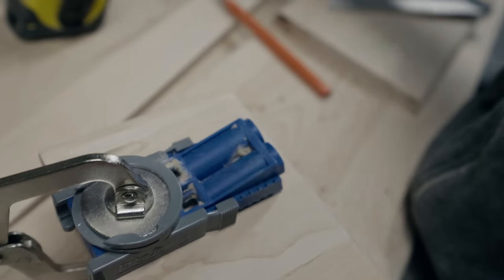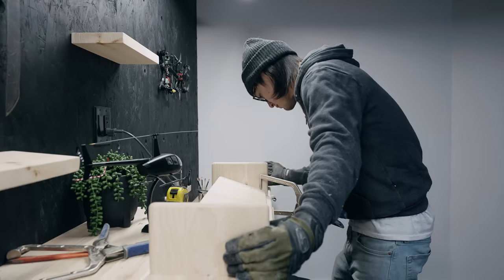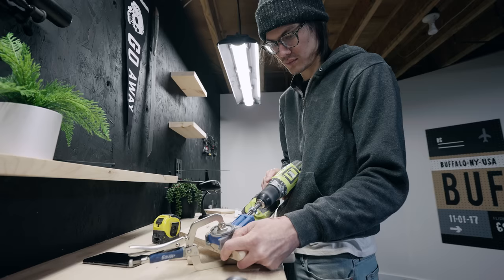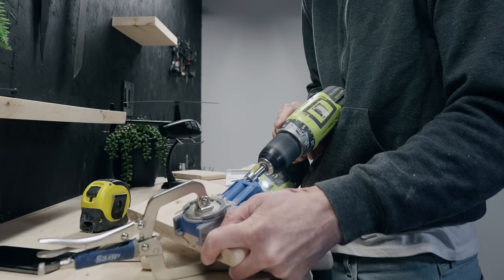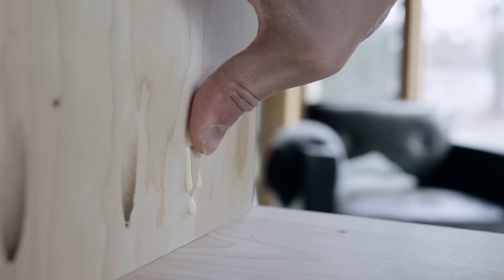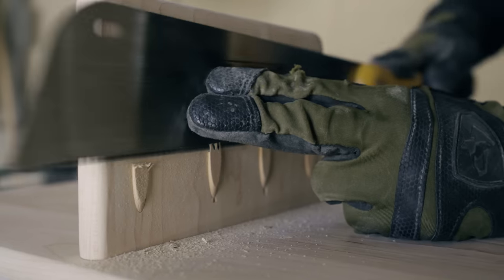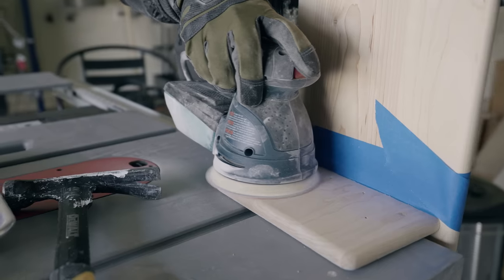After dry fitting all the pieces for the desk shelf, we assembled it to make sure everything fit and looked good before finalizing the finish. For this project we attached everything via pocket holes. This company Kreg makes little jigs — they make the best stuff. It essentially allows you to join two pieces of wood together with these hidden side holes. We left the pocket holes open in the back since nobody will see them, but we filled the visible ones in the front for a cleaner look. Kreg actually makes pocket hole plugs that match perfectly — a bit of wood glue to stick them in, and once cured we used a Japanese pull saw to cut off the excess.